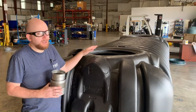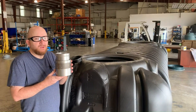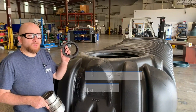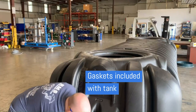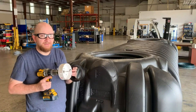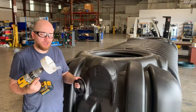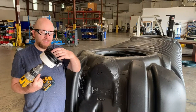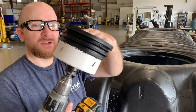Once we've determined which side or end we want our inlet on, we're going to install our smoothing inlet. In order to do that we need to drill a hole in order to insert a 4 inch gasket. For a 4 inch gasket we're going to use a 5 inch hole saw. If you're doing a gasket of a different size for another application, you can always tell which size to use by holding it inside the hole saw until you find one that is approximately the right size.